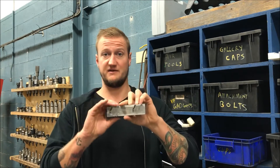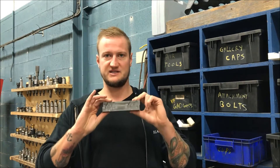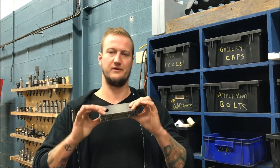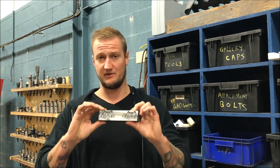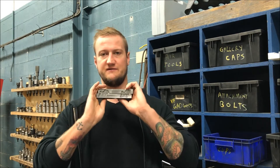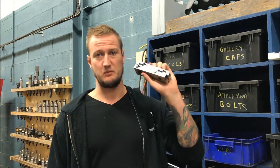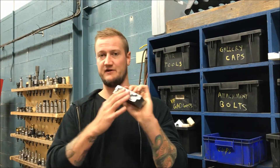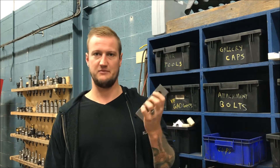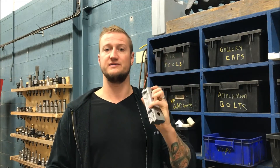These jaws themselves have run a few thousand steel parts with absolutely no sign of wear whatsoever. The downside is these are time consuming to make. If you're not specializing in hard milling, it took a couple of hours to get to a place where I liked it with a finish I liked, because these are very hard. The good side is if you're doing a lot of parts, this is a very easy way to do them without setting up for a massive fixture. For these ones here, we had four or five vices set up with this profile so we ran a lot of them at a time. If you're doing tens of thousands of parts, you may want to be able to do 10 to 20 at a time — after that, we move on to actual fixturing.